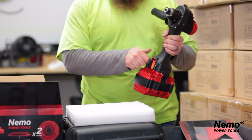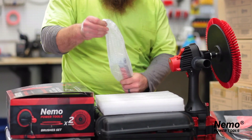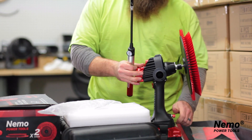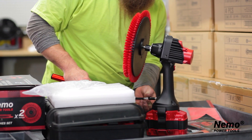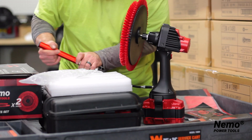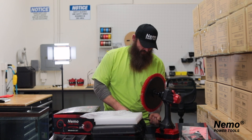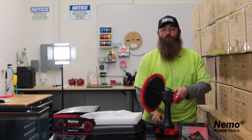When you want to pressurize, your pressurized valve is down here. To pump up your tool, simply remove your air pump and air valve from the bag, screw your hose into the pump itself, remove the valve cover, screw this onto it, make sure you get a nice snug fit, and pump. This is to ensure that no water gets near your tool while you're using it underwater. Simply take it back off, reapply your cap, and now you are all set to go underwater.